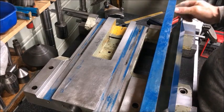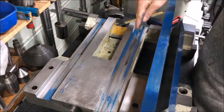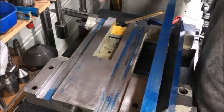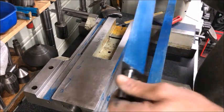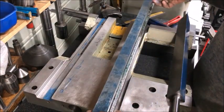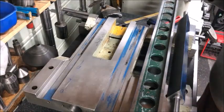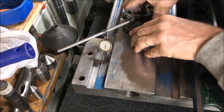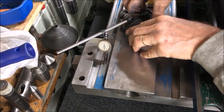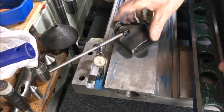I've applied a very light coat of blue — not to scrape, but just to detect and show the wear. I used a longer straight edge as a test piece. The trouble with using a shorter test piece is that it just follows the curvature of the surface and gives misleading coverage — that's a no-no. With the blue applied, I can then run the indicator to measure the wear, and verify that where the blue has transferred it is worn. The amount of wear in that region is five or six hundredths of a millimeter.